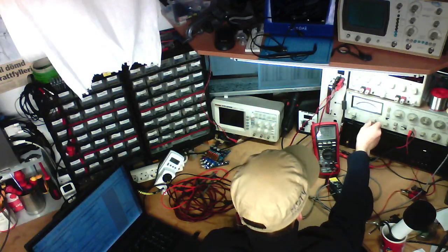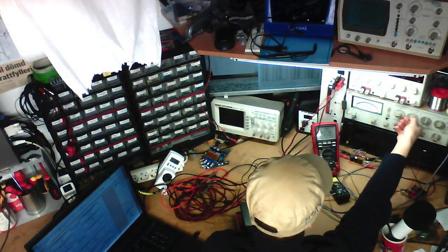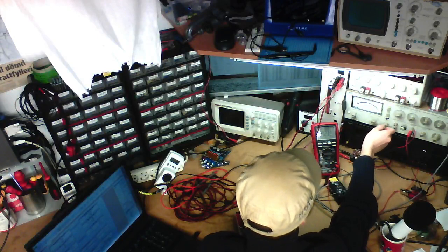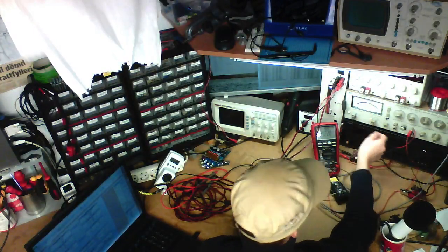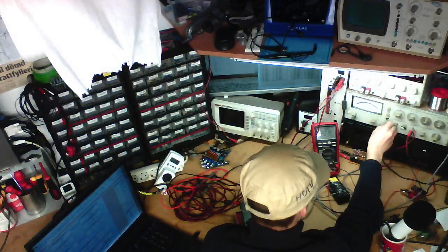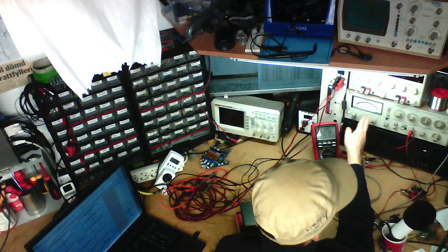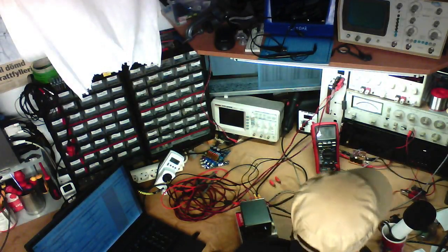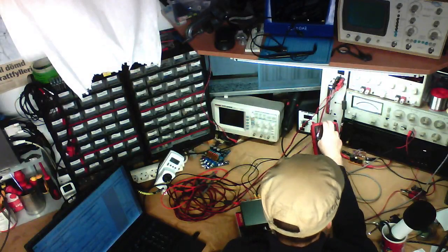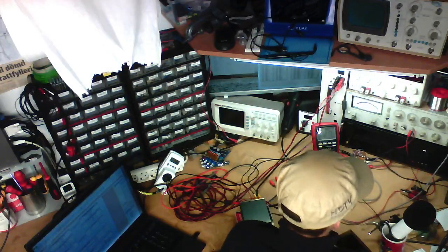And we want to adjust the distortion meter to measure the input level. 30 volt range, that's fine. We want to have a relative measurement. That's a great feature on this 339A. You have this relative measurement functionality where you can just trim a certain signal to be your 0 dB reference. Then you can adjust whatever parameters and get a direct reading in decibels of what your difference in level is. I haven't ever seen a multimeter which has any such functionality. This Brymen certainly doesn't have it. It just has some weird dBm functionality which is useless for this.